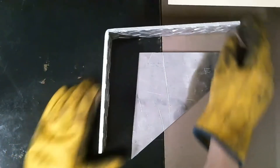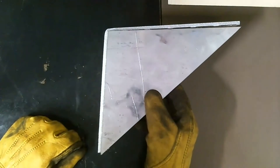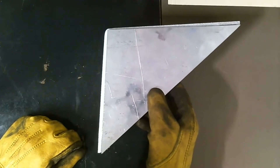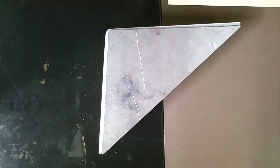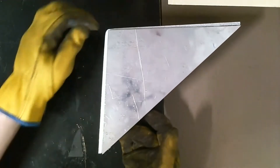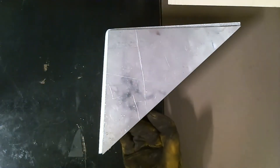That wraps around the outside, then this triangle will go ahead — we'll weld it together like so, and this will sit on top of the boat deck. One thing I forgot to add after I cut it was a little tab here for a rope tie-down, but that's okay — that'll just be a little bit of welding later on. Now the next step is really to weld these two pieces together. We've got quite a run of outside corner welds, probably going to end up TIG welding that with the aluminum filler wire.